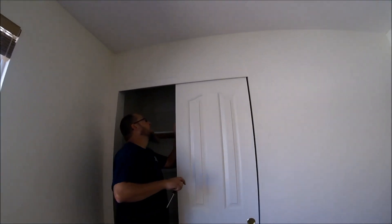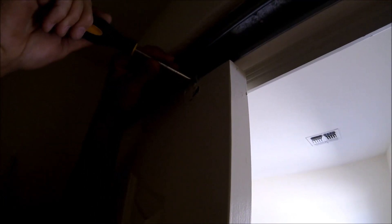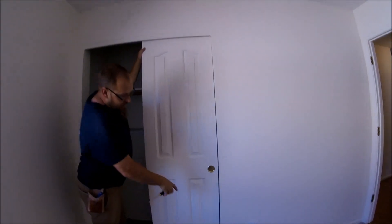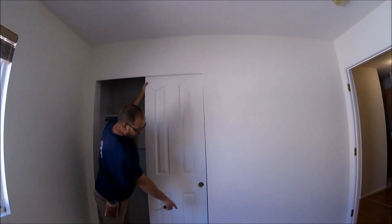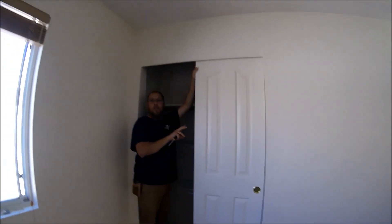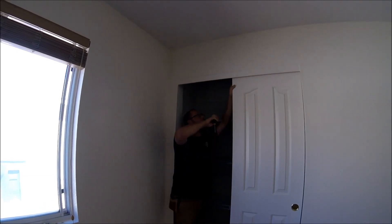Come right in here and watch. You can see I got this staged like this on purpose just for the sake of the video — see how much of an angle that is right there. I'm going to take my screwdriver, loosen that a couple of turns like I said, push that down, and pick up on the door at the same time. Now as I'm holding it I want to look — I pushed it all the way up flush and that's actually too much. Now I've got a tight spot here and a gap down there. So while I'm inside I just want to look at the wall and make sure it's flush with the wall.